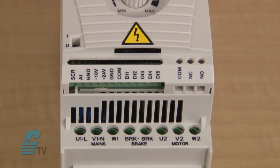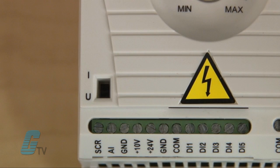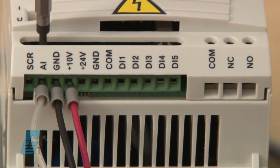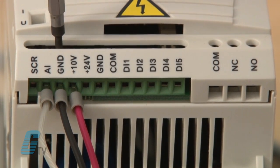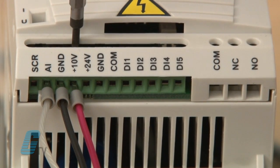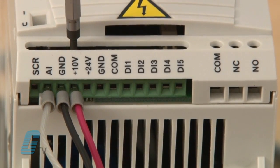I will look at my I/O strip above the input power connection. There is a switch above the terminal for either a voltage or milliamp signal. I will make sure this is set to U since I will be installing a potentiometer that requires a voltage signal. I will connect my potentiometer with the wiper being placed on A1. The common should be installed on GND and my third wire will be installed at the 10-volt reference voltage.